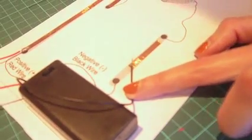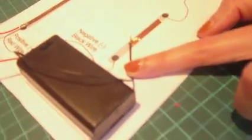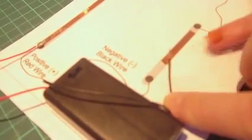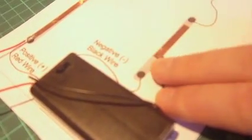I'm not sure how I can do this actually with one hand. Can my cameraman hold the negative wire please in place? Excellent, thank you very much, Mr. Cameraman. So I'm heating up that wire there, making sure I'm nowhere near his fingers, and I'm then introducing my solder into that joint, and you can see that smoke. Oh! And that's joined on.